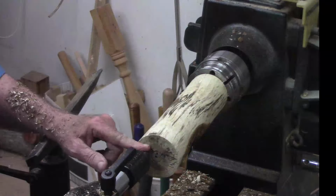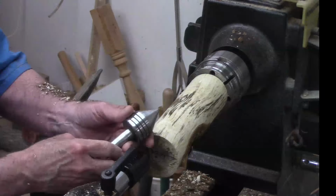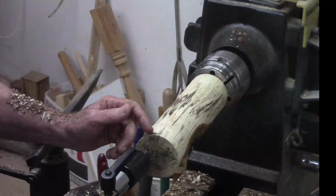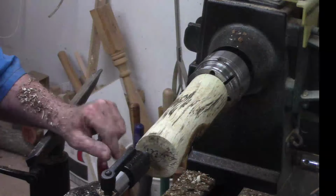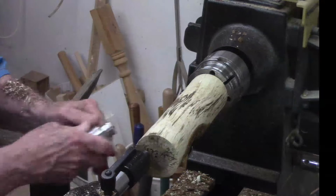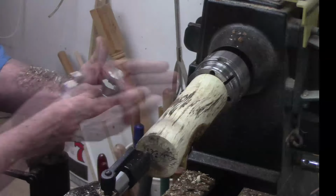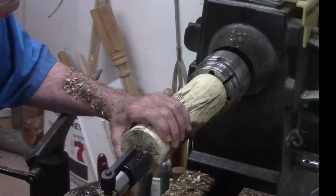Now, when you go to turning this off center, I'm not real excited about using a 60-degree cone because it's not going to hold as well as a ring center, such as the Powermatic or Robust or Jet original equipment manufacturer that has the cone on it that you remove, or this Record Power ring, because you're going to get a better bite when this is off axis a little bit. So we're going to use this one. We're going to start with five.